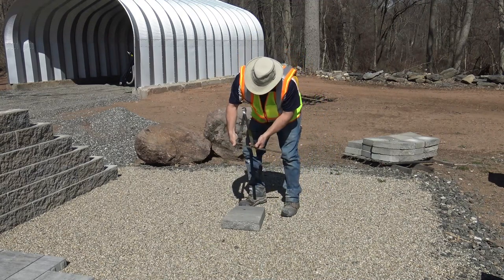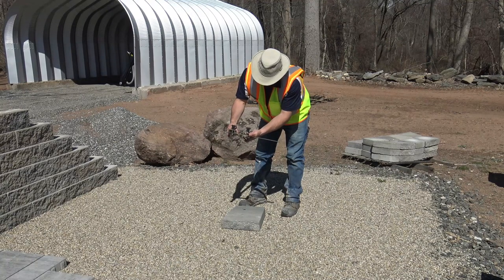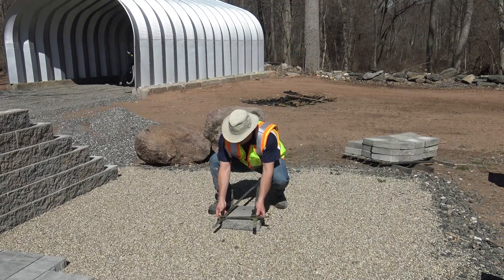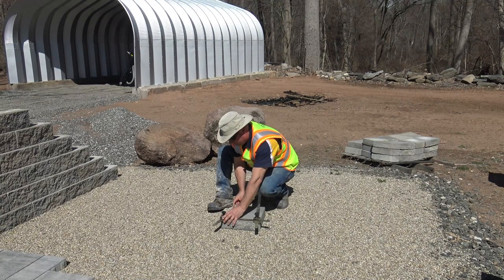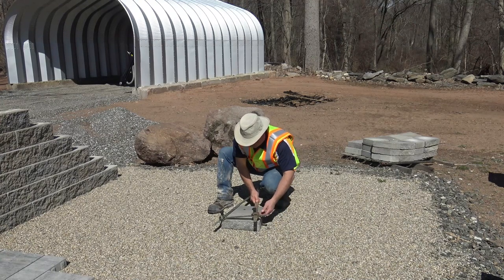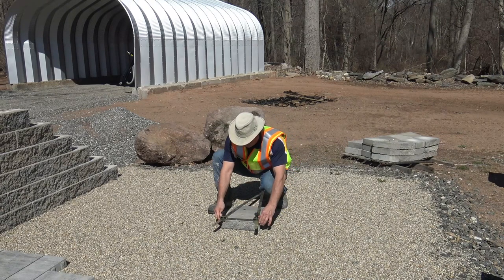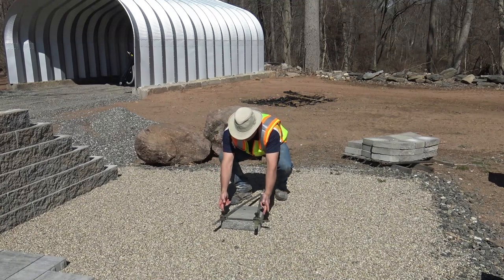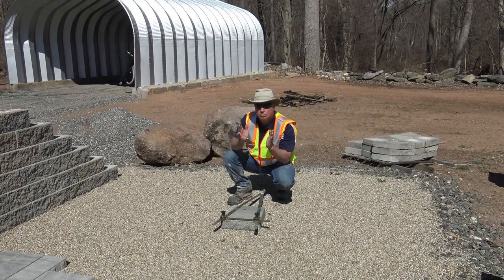You can see on the back I've got my notches. I'm going to set 31 on one side and 32 on the other — same on both sides. I also have these little ears; this is what is going to wrap around the top of my cap. So I just lock these in at 31 and 32, tighten that up. I'm going to adjust my width and my length and tighten these up. As you can see, I've got a perfect wedge-shaped piece. When I cut that, every one of these pieces around the entire fire pit will be exact.